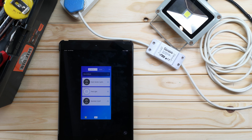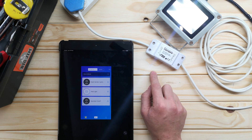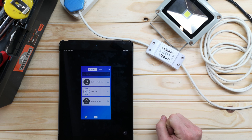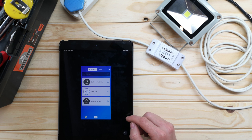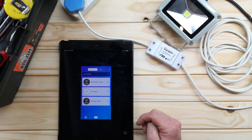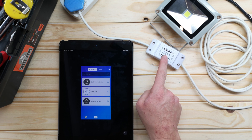All right, we've finished wiring our Wi-Fi switch. Now we've plugged it into the power - we can see that this light with a Wi-Fi symbol next to it is just flashing on and off, showing us that this device is not configured and not connected to any Wi-Fi. We can test if the device is working by just pushing the button next to it - that toggles the relay inside, so if it's off it switches on and if it's on it switches off. So we know the power circuit is working, but now we need to connect it to the Wi-Fi. Before you do that, go and download the eWeLink app - it's available on the App Store for iOS and the Play Store for Android, and I'll put links in the description below.